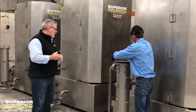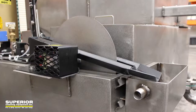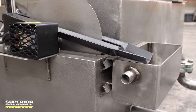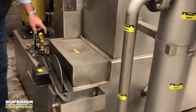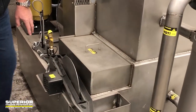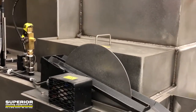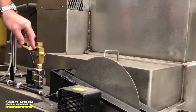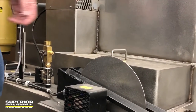If you come around here, we've got an oil skimmer — a stainless steel oil skimmer wheel. We've got a DEMA injection, automatic chemical injection on this unit, and what that does is it allows us to inject chemical every time you add water. Even on a stainless steel machine, you want to make sure you have the right amount of soap, so we're going to put a chemical line here. This is your fresh water inlet that goes into here. Very nice feature.